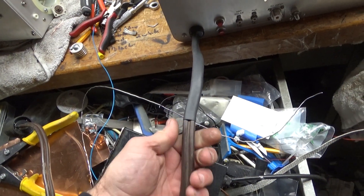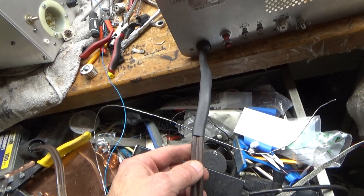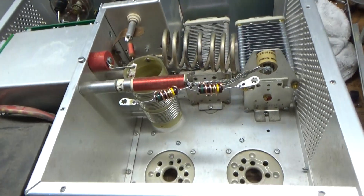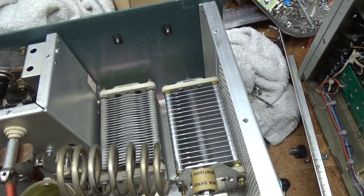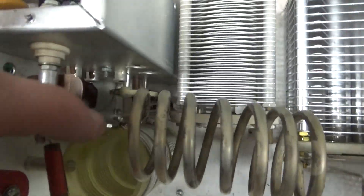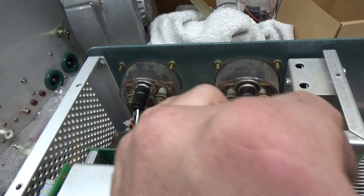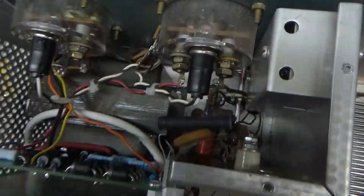It's wired for 240, so it was fine. I just put heat shrink over it — there's no damage to the insulation on any of the conductors. New parasitic suppressor resistors. New plate blocking cap. New air variable capacitor on the plate side. Cleaned the rotary switch with Deoxit Gold. Had bad solder connections in there, took care of all of that. Took the nuts off, tightened the inner nuts. New meter lamp bulbs. Harbach metering board. Harbach filter cap board. Series glitch resistor series with the B positive.